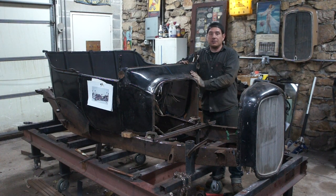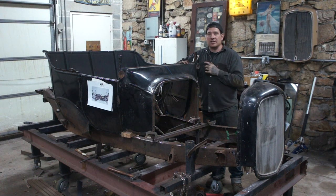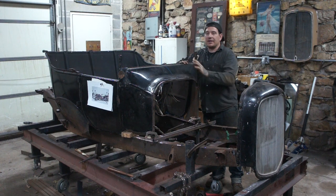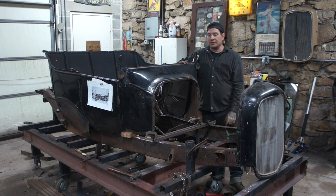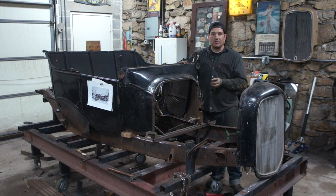We're dealing with basically 100-year-old metal, so there was some paint, some primer that I had to cut through. I used the Eastwood Contour SCT, worked really well. Blew through all that, but then I needed to take 80 grit and a file and really clean up in this area. And then I actually took a sander on the inside to get all the surface rust that was underneath here to make sure I had a really nice clean weld seam.